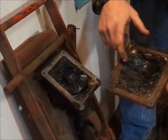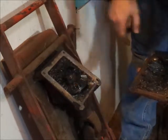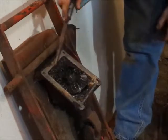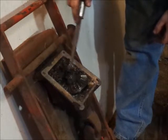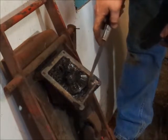What happens a lot of the time is the grease gets hard. Now this grease isn't hard, but as you can tell it's all slung away from the gears. I can't really tell how it looks - chunky - I'll grab a screwdriver here. It doesn't look chunky, it's all fairly pliable. There's not a lot of grease in it. Looks like people have added some grease to this every time.